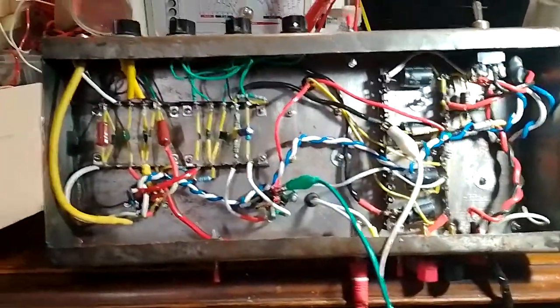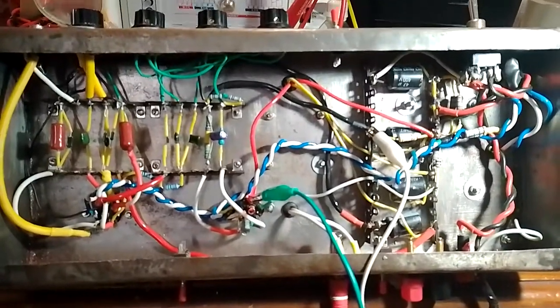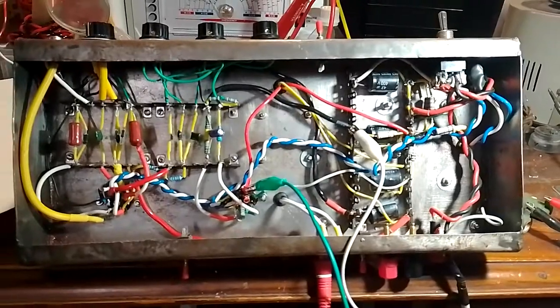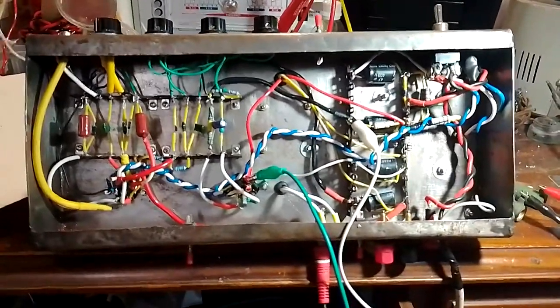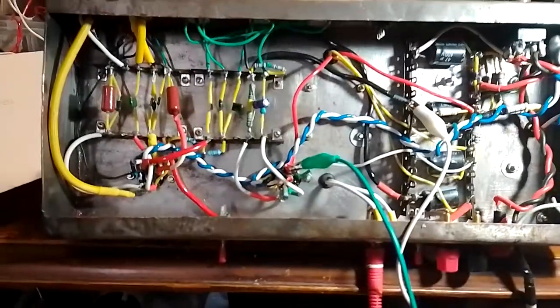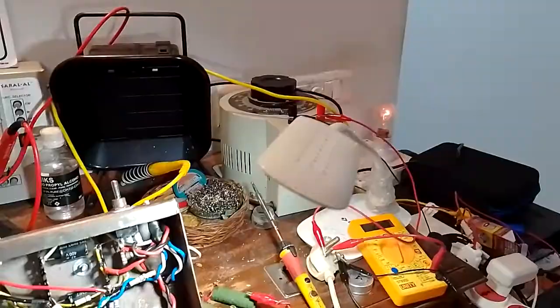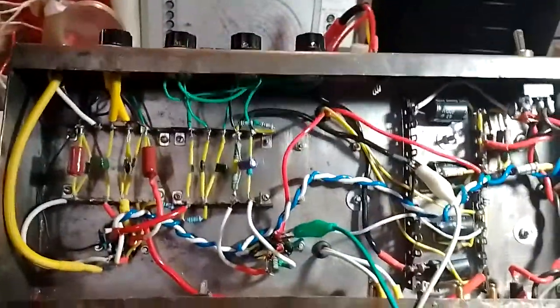All right. I decided to go ahead and wire up the EL84 output stage while I wait for my replacement 12AX7 valve to arrive. I decided to try another valve to rule out a mislabeled or worn out valve before messing with the bias for the preamp stage. So yep, now the EL84 stage is wired up. Currently the amp is powered on as usual through the dim bulb and the isolated variac. The EL84 is plugged in, but not the 12AX7. Things seem to be all right so far.